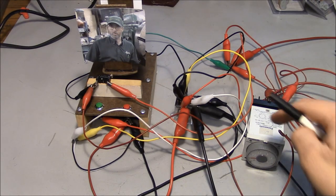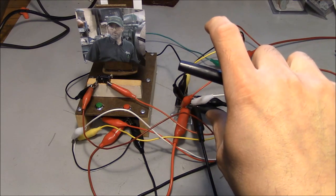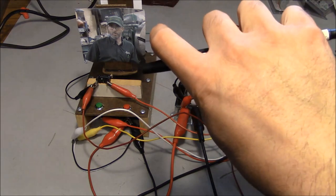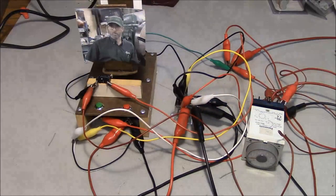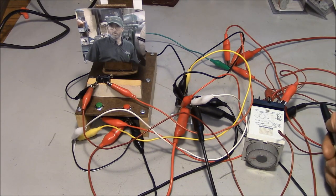And it has a timer relay that controls that. It basically just switches the polarity for like half a second so it stops the spindle. Well, the timer went wonky, and it was holding the thing reversed for like 5 seconds. So it would stop the spindle, and then it would ramp it up in the opposite direction. So once we figured out that the time base was wrong on the timer relay, it was no problem to fix that issue.